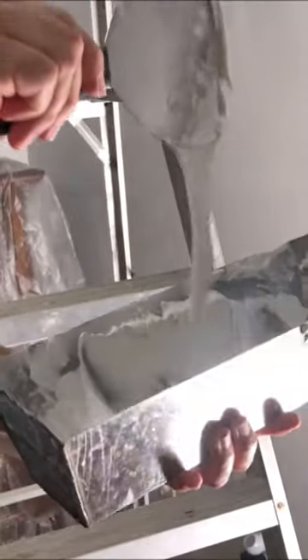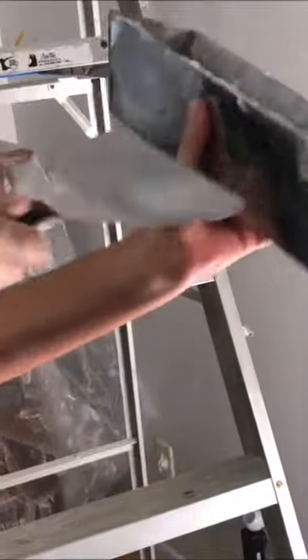This is a good way to tell how thin or thick your joint compound is — just by letting the joint compound flow off your knife back into the pan. It shows exactly how thick or thin it is.